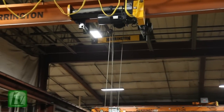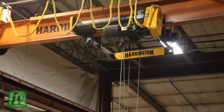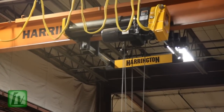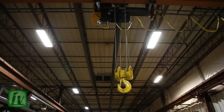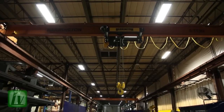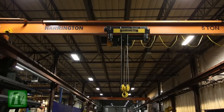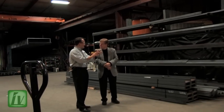The things that we've done to hoists these days — we've actually put some intelligence into the controls to monitor the hoist, make them safer, make them last longer. This particular unit, the Rhino, has what we call the RPU, the Rhino Protection Unit. It's inside the control cover of the hoist and it has five main functions. First of all, overload — in the event that one of the motors overheats, the thermal overload kicks in, and the RPU tells the hoist to stop until it cools down.